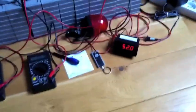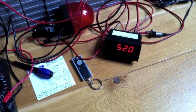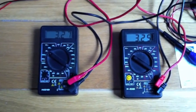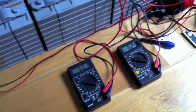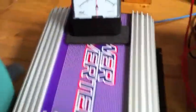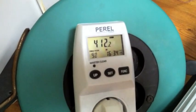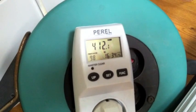About 10-15 minutes after starting, you can see the voltage has dropped about 2 volts. The cells are back down to 320-327 — they were 330-337 before. They're going to stay like this, decreasing a little bit at a time. We still read 10 amps more or less, but the watts being fed back into the grid or house system have gone down — it's going to stay around 410-412 watts.